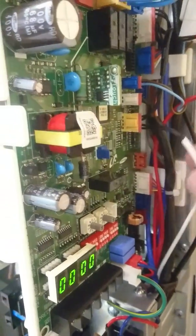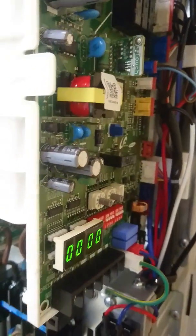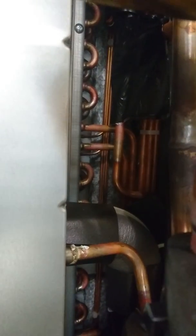The white sensor here is the flow out of the unit into the heating system. If you follow the white cable all the way down, you can see — if you go around the back — that the white sensor connects into this tube here, which is the water outlet to the heating circuit.